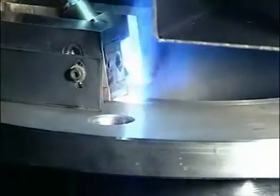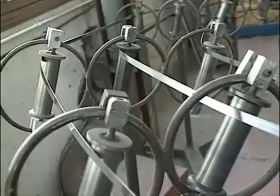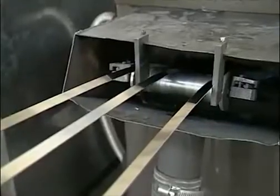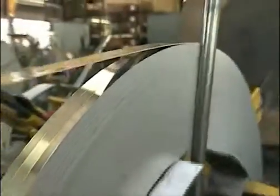Laser welding can be used for thick as well as thin material. The edges of this thin strip are going to be welded to the edges of two others by electron beam welding. This type of welding was chosen because the heating is so localized that distortion cannot occur. Neither can heat tinting. The welding is done in a vacuum.